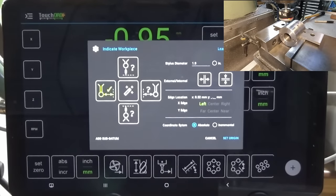I'm going to go ahead now and I'll drill and tap. Now I'm drilling 3/16 for the ball, and then I'll back that up with an M6 threaded hole for a socket head grub screw. And then we'll do the assembly and see how it fits. But before I take this part out of the vise, I'm going to sweep between the jaws here with a dial test indicator and just see how close we got with that probe.